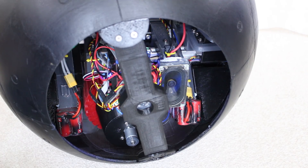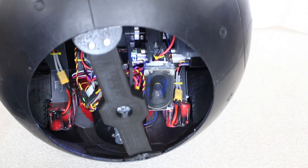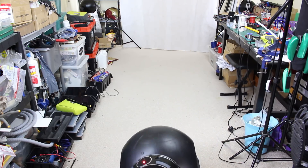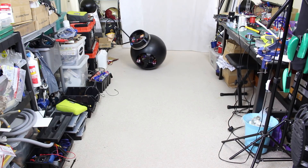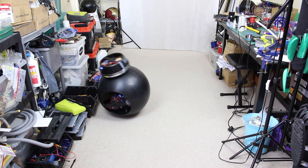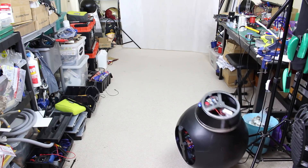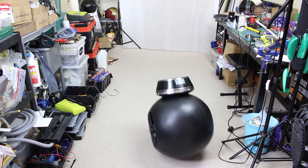Now the head is on, I've had to do something to the stabilization — instead of the side-to-side axis moving with the motion, it now moves in the opposite way. That works quite well to actively pull the droid back on, and that's basically because of the extra head mass. It seems to drive alright on the carpet at least, and I can throw it around quite a bit. My head's held on pretty well — I've lowered those magnets as well. It should stabilize itself pretty quickly, even if I bump into things.